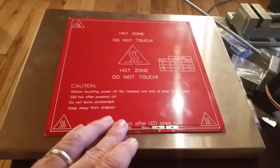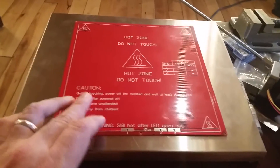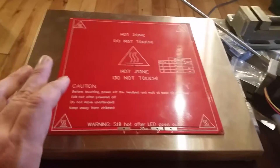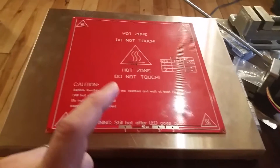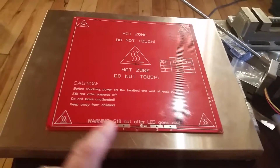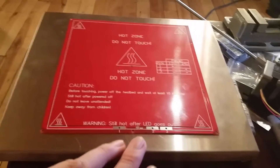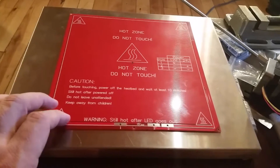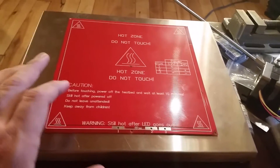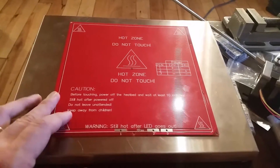You essentially want to get this sorted out before soldering. Sometimes if you've done a bunch of through-hole work, you'll notice after all your soldering it now has a warp or a bend or a twist. You can bake that out too, but you've got to watch because your components might not be able to take the heat. It's the same idea as a reflow oven — in fact some boards are better to solder in a reflow oven because some of those actually won't warp if the job is done that way. You could also put clips around the border to a piece of metal that's straight and heavy enough not to move. But in this case I did a sandwich between two pieces of steel and it worked.